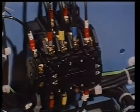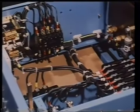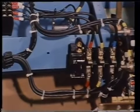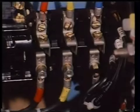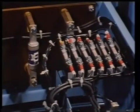The contactor coil also acts as a no-volt coil protection, interrupting the circuit when a serious and prolonged voltage drop occurs. This feature prevents the motor automatically starting after a power interruption. The control circuitry has its own set of fuses.